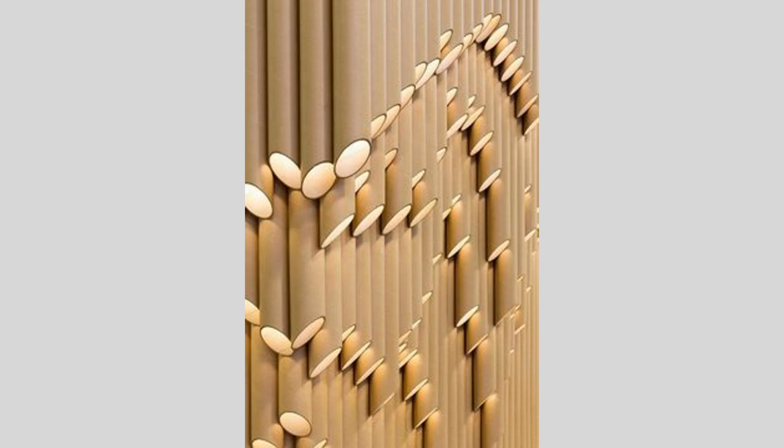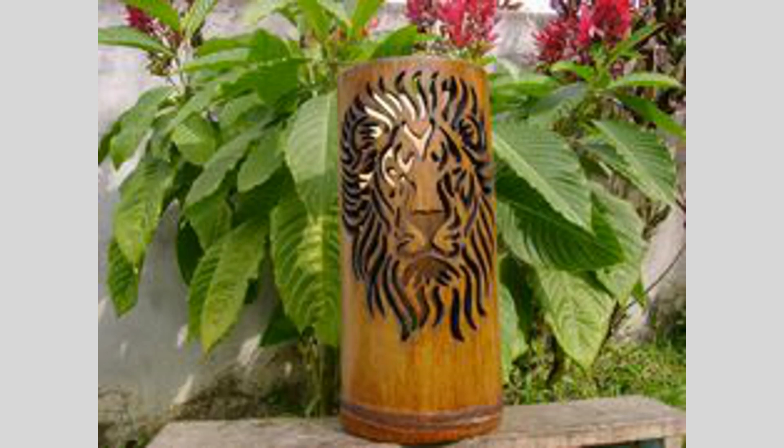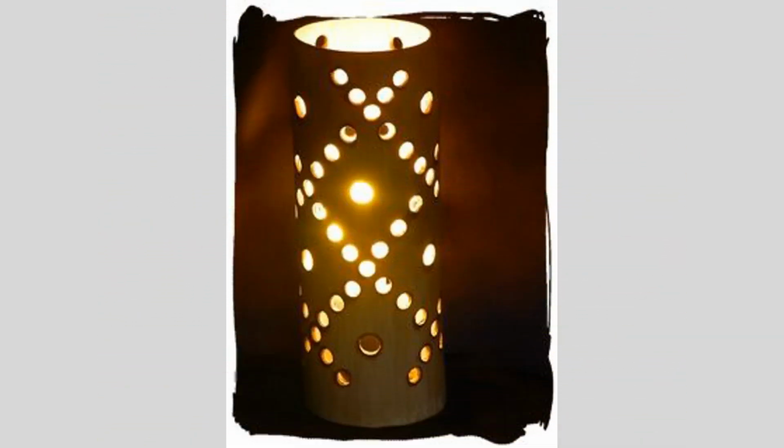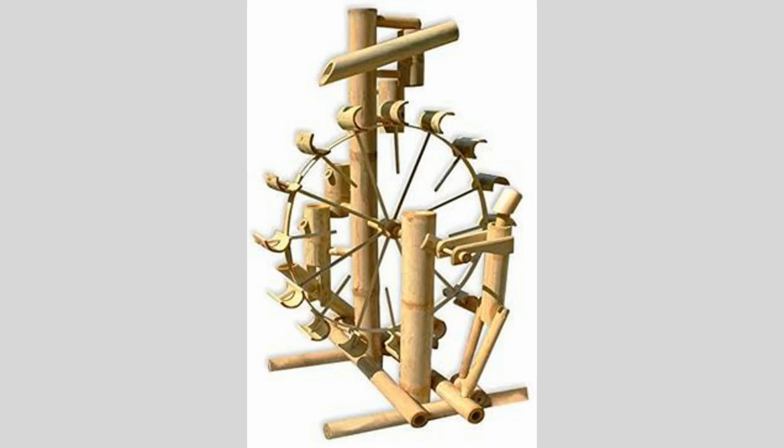Bamboo fencing should be affixed to an existing wooden or chain-link fence for support. You can use drywall screws, coated deck screws or zip ties to attach the bamboo poles to the framework. Purchase bamboo fencing, which comes in rolls. When rolled out, these fencing sections span a long distance. Each bamboo pole is connected to the next with galvanized wire.